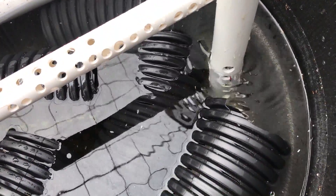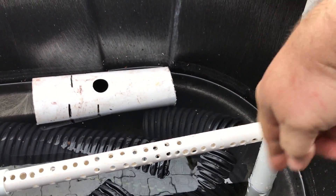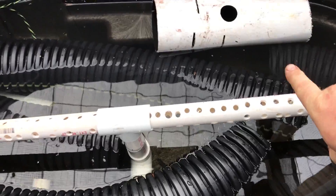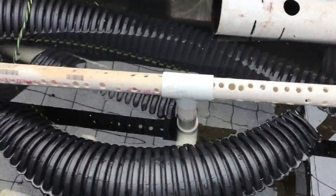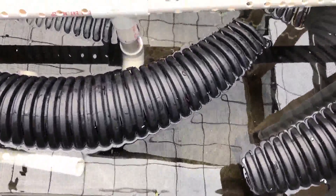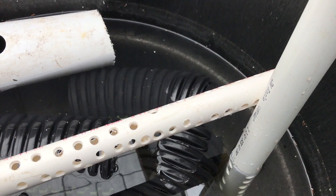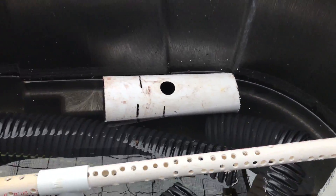The holes at the bottom ensure water circulates and moves as it dumps out. That tee is probably overkill — it could be about that long in both directions and be plenty — but I believe in overkill because there's no way it's going to get a hundred percent stopped up. Now, I really don't want water up to this level while filling. What you're looking at is the system level — this drain line is the stasis level of the system, so it will never drain down beyond that; it could evaporate but won't drain below that line.